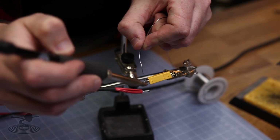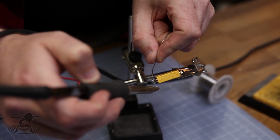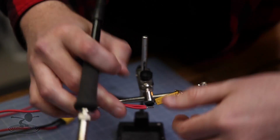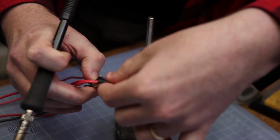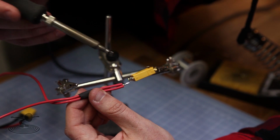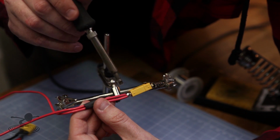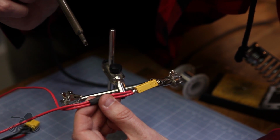Okay. And again, whenever you solder two big things together, you should always heat both pieces so they're at the same temperature. Making pigs here of this. Helping hands are sometimes not so helping. Yeah, this is because I'm showing the camera as well. So you always want to heat both pieces before you join them. You shove it in. I like how you put one on one side of the soldering iron, one on the other. Exactly. And then just push them together.